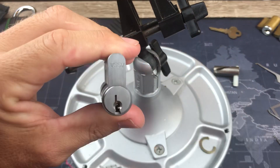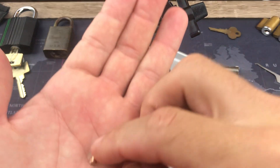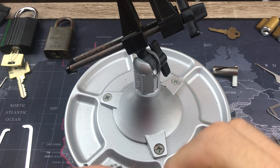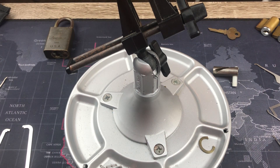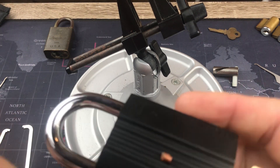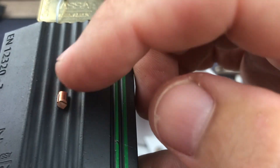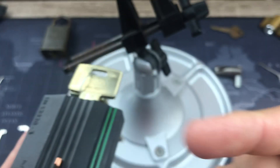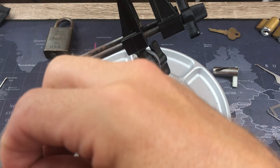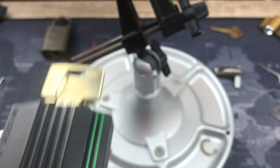Okay, so I think that's gonna be good enough. This is the back pin — you can see how these pins are beveled. Maybe I'll try this little guy. That's not the best way to show that pin either. Oh look at this — I like this to show off the key pin. You can see how chewed that thing is, and how this back pin is there. What makes it even worse is I think this back pin is in there that way, and then this is the pin that comes before it. So you can see I've got my work cut out for me to get around that.